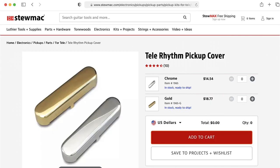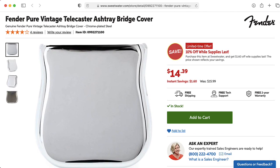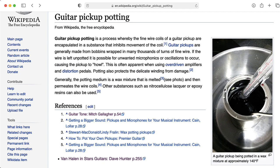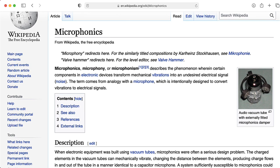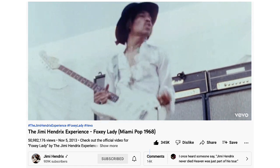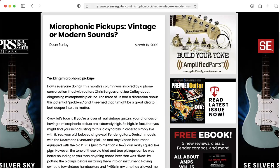Notice that other metal used in the pickup — for instance a metal base plate or some sort of metal shield — can have an effect on all of this. Wax potting is often used to help hold things in the pickup in place so they don't vibrate and rattle around, and this helps with microphonic feedback. Microphonic feedback is where the sound from the speakers will actually rattle the pickup itself, and that's a bad thing. The good kind of feedback is where sound from the speakers will vibrate the guitar string — Jimi Hendrix used that kind of effect a lot — but feedback where the speakers rattle the pickup is bad.